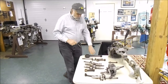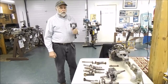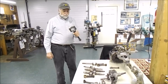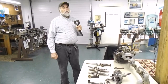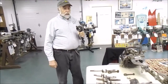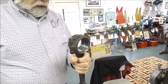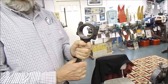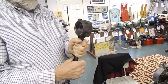This first example is not an outboard motor bearing, but it's a really good example of what's called a Babbitt bearing. This is a mid-twenties automotive piece, and it's very typical of the technology from about the earliest times of gasoline engines. A Babbitt bearing is actually cast into this forged steel connecting rod. A 1907-designed ferro engine had poured Babbitt bearings.